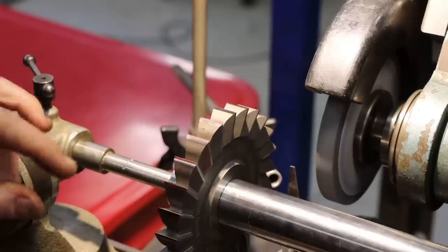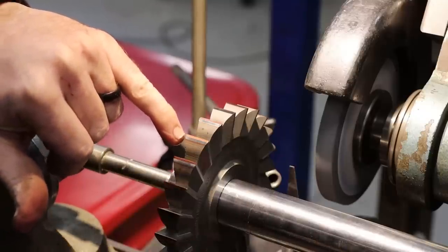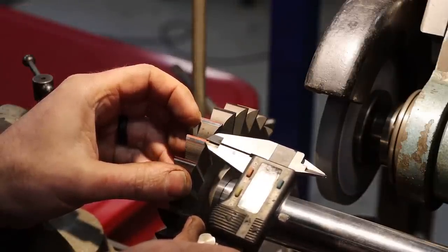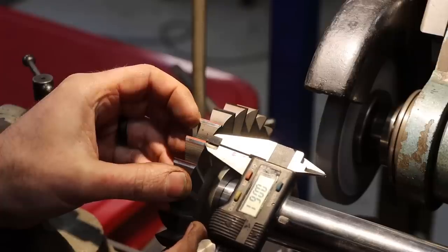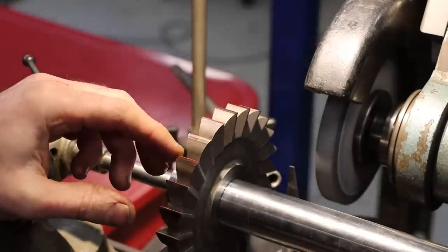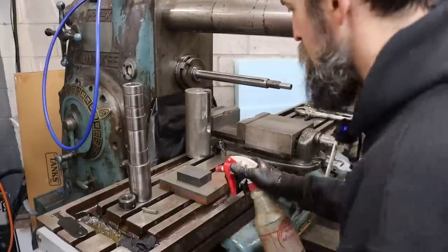All right, so I think I'm done grinding. That looks exactly the same as grinding the primary cutting edge. What I'm doing is regulating the thickness of the primary cutting edge, the little red band that's left there. I wanted it to be anywhere between a 16th and a 32nd. So we're about at a 16th, just going to leave it there. As best as I can tell, that looks pretty good. You can see the band that we ground and the cutting edge that's left behind.